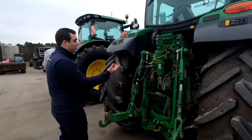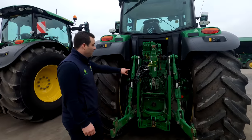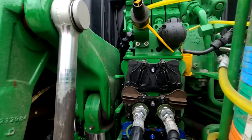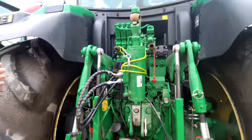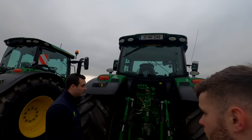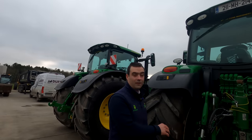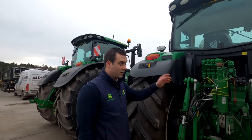Going round to the back, this tractor has four electric SCV valves — the high flow 450 valves. One thing to know about a John Deere: this tractor has a 155 litre pump and if you put a flow gauge on the back of those spools, it's actually putting out over 160 litres of flow. Some manufacturers advertise massive hydraulic pumps but if you actually put a flow gauge on the back of the spool you're not getting anywhere near what's on the brochure. On a John Deere, the flow is actually better than what's written down.